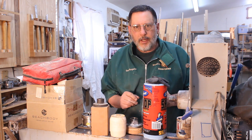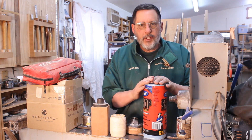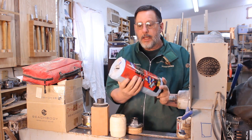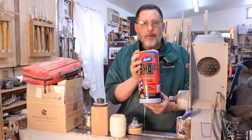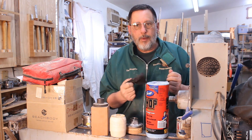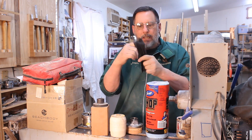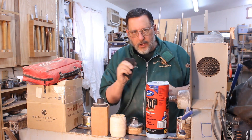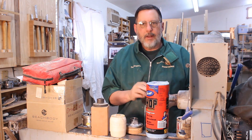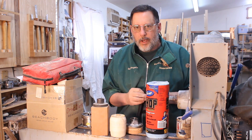The first thing I'm going to talk about is finishing something on the lathe. We often use a paper towel, and I like to use shop towels made by Scott — you can pick those up in a lot of places and they'll rip. But if you have a piece of cloth wrapped around your finger while finishing something, that's not good. Do not use cloth.